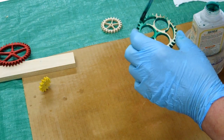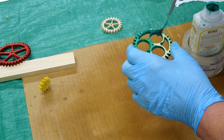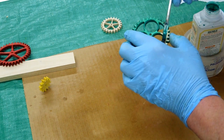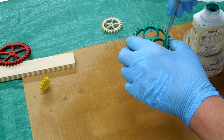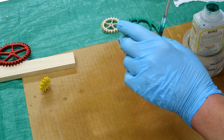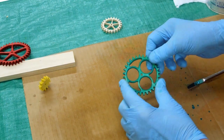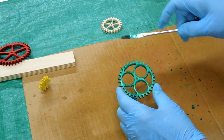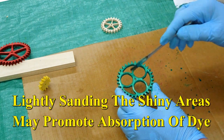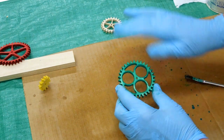I'm finishing up the green one. This dye is staining these gloves, so you can imagine what it would do to your hands — gloves are advised. Wood is not a homogeneous material; it's not going to take the dye evenly, so you may have to go back and give it a second coat. On some colors, possibly a third, to try to even that out.